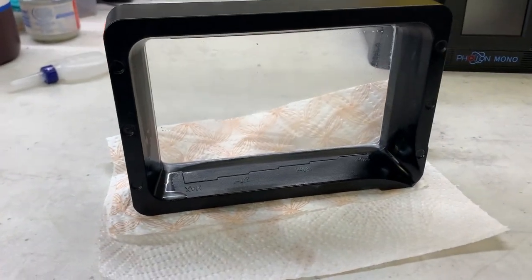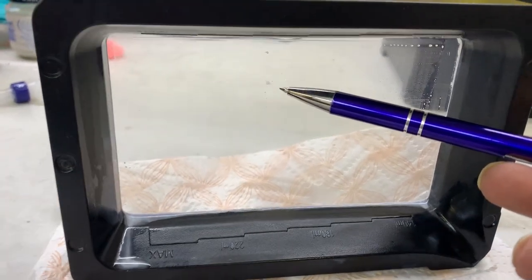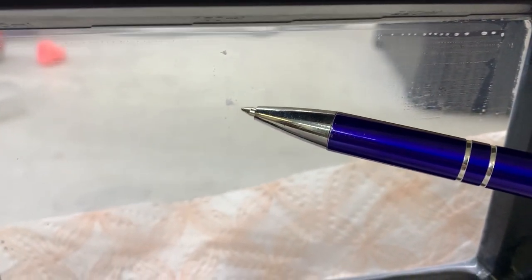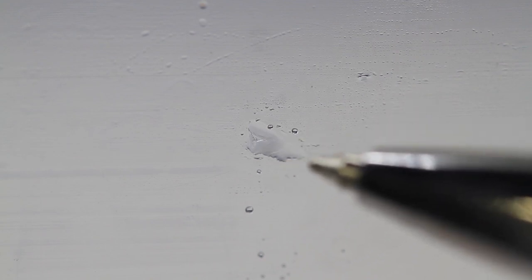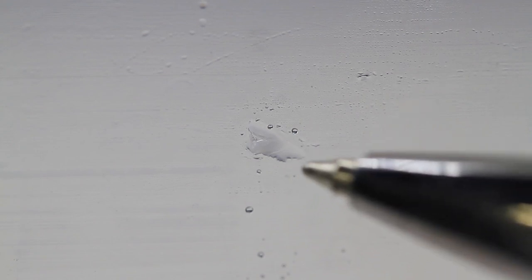Here's the vat removed — you can just see a blemish there. That's the defect we need to deal with. On close-up, it looks like a blemish but there's actually a pinprick hole. There's a little bit of cured resin blocking the hole, and if you remove it the FEP leaks; if you leave it, you get a defect in the printed part.